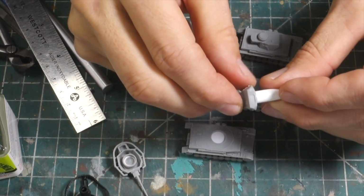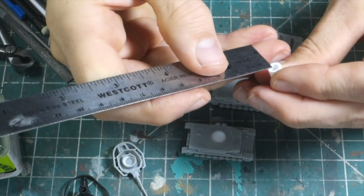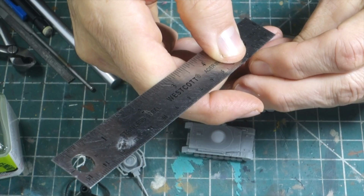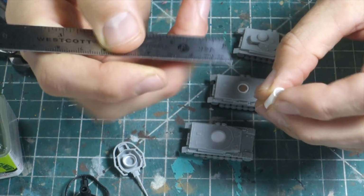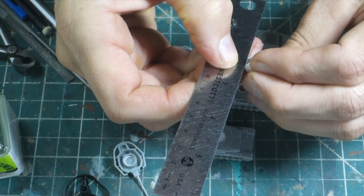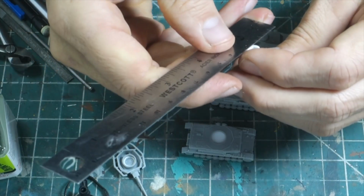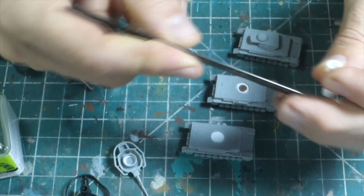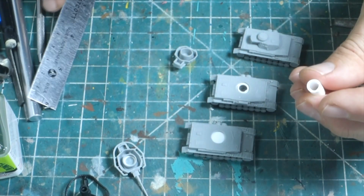To create the assembly for the rare earth magnets, you're going to need a piece of tube that is about 5 millimeters in diameter, just shy of 5 millimeters. Probably about 5 millimeters in diameter through the center. So a 5 millimeter rare earth magnet will probably drop in there. That's probably about 3/16 inner diameter. And outer diameter on this looks to be about 7 millimeters, or 1/4 of an inch. So you just need the one diameter.